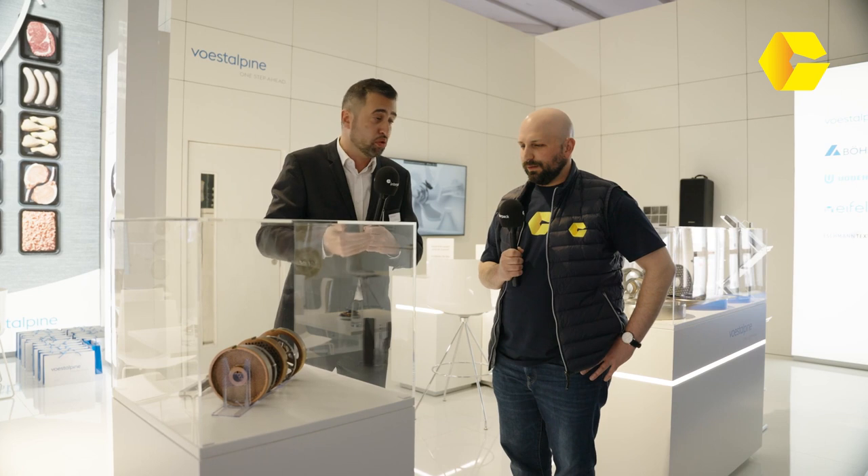Usually a customer would use a grinding set for a month or two and then needs to exchange them. But with certain regrinding processes, which are very minimal, you can work up to three years with one setup. Most machine manufacturers are not eager to promote that because it affects their spare parts business — we understand that. But we also get approaches from food processors who say: I don't want to stop in the middle of a production shift to exchange cutting tools. Instead of six or seven hours before regrinding, this extends to 100 days — and you can use it up to three years.